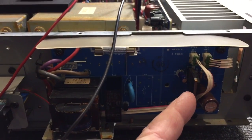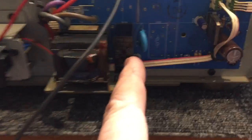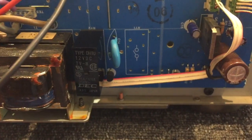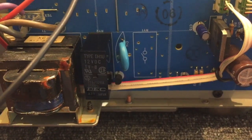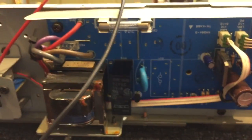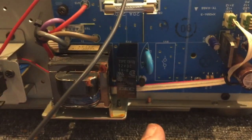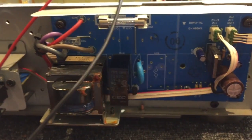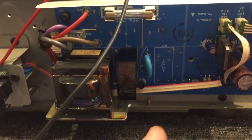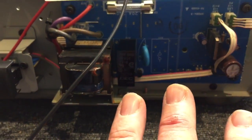The whole thing was just loose. This relay had one lead that had literally vaporized - all of the area around the lead had vaporized so it was no longer attached to the printed circuit board. In other words, the amp couldn't turn on because this relay could not switch it - the mechanism by which that switching would occur was disabled because the components were no longer soldered to the board.